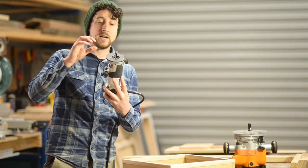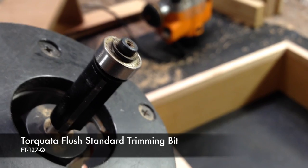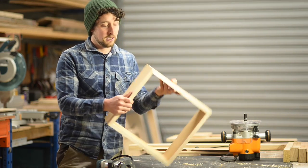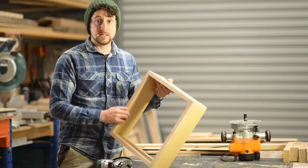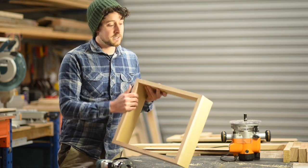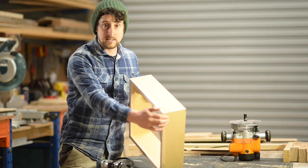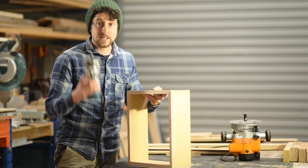The second flush trim bit is a little bit larger than the last one. It's 12.5mm in diameter and about 25mm, or 1 inch, long. What I'm going to demonstrate with this bit is trimming a hardwood face to match up with a cabinet - a really common use for a flush trimming bit. Often it's not practical or economical to make an entire cabinet out of solid timber, so you'll put a hardwood face on it. This is an MDF carcass with a Tasmanian oak bead around the front, and the Tasmanian oak actually overhangs the MDF slightly.